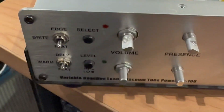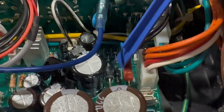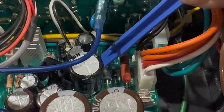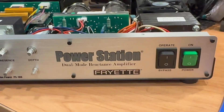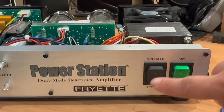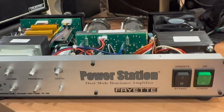I'm happy to announce that all I did was replace the burned-up 10 ohm resistor and the 1N5372B diode. The unit would turn on, the power light would come on, it would pass signal in bypass, but operate was no change — which makes sense because the relay circuit wasn't activating to kick it into operate mode, as far as I understand how the circuit works.